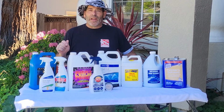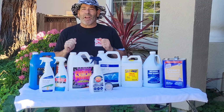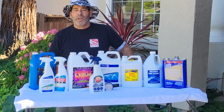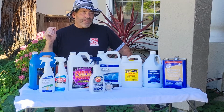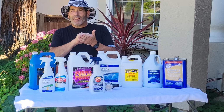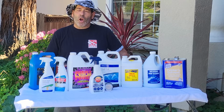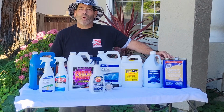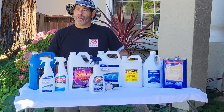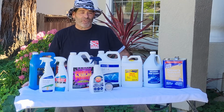You want to clean all that glue off. You can use a green scrubby. You can even use some light sandpaper, but be careful not to take material off your boat because that's going to weaken your boat. Those work well. And then on your patch, you also want to rough it up with a brush or some kind of an item just to take the sheen off, and then also use the MEK or cleaner, paint thinner, toluene to prep it. And then you're going to follow the instructions for one or two part glue. See my other videos about patching.